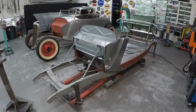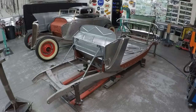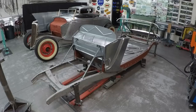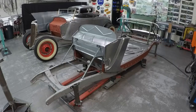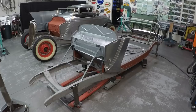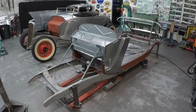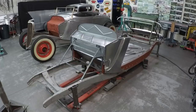There you can see the other side. It's important to work parallel with left and right side at the same time. Each student making parts is making left and right side simultaneously — run one bead on one panel, then the other bead on the other panel. It's much easier to keep track and make them symmetrical, and the chances are much bigger that they'll fit correctly when put on the car or firewall.